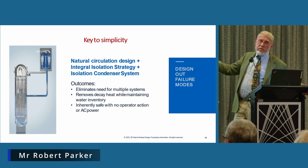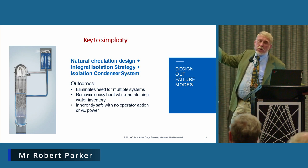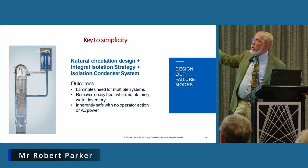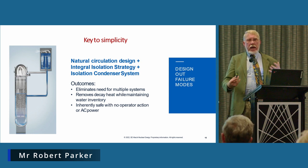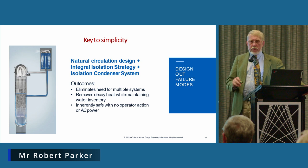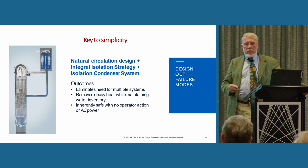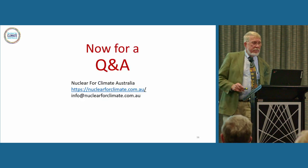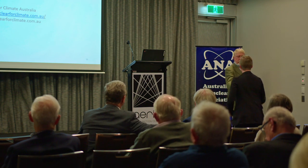They've got about three circuits, but only one is required to enable the device to cool itself for seven days. Putting it all together, it's a very simple reactor that contains three major components: natural circulation, plus the integral isolation strategy, plus the isolation condenser system. All three of those innovative parts combined together give you a very simple, safe reactor that has also pulled 50% of the equipment out — and you need to in a small modular reactor, because you've got a lot of fixed costs compared to large plants that make their cost case somewhat problematic.